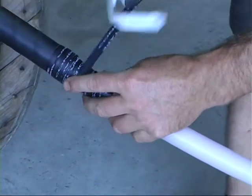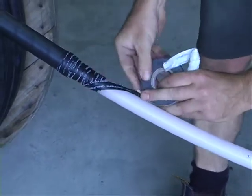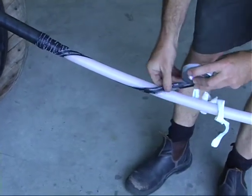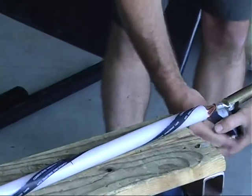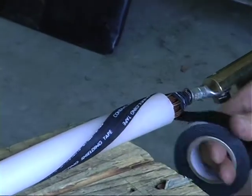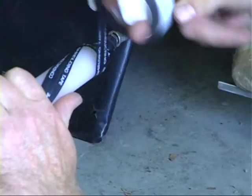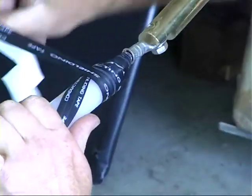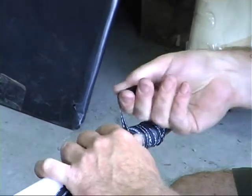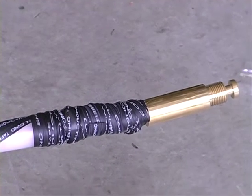Over-wrap the tape back towards the original starting point, but again do not cut the tape at this stage. Continue to wrap the tape around the white insulation with only slight tension, ensuring the tape is not too loose. The spiral needs to be applied with an even pitch to achieve the best performance. Once the tape has reached the crimp, stretch the tape using a 50% overlap to cover the last three centimeters of the white insulation, continuing over the brass connector and up to the black plastic section of the terminal base assembly. Cover the connector with tape whilst maintaining a smooth and level finish.